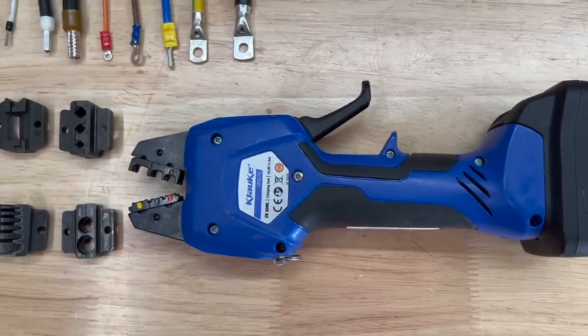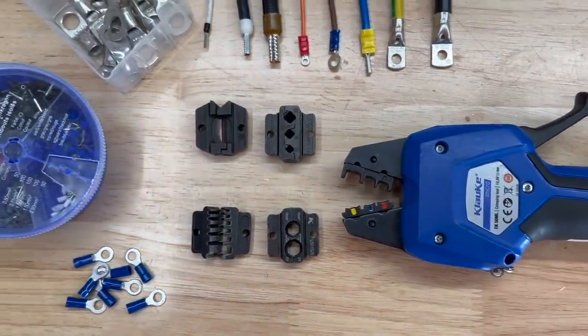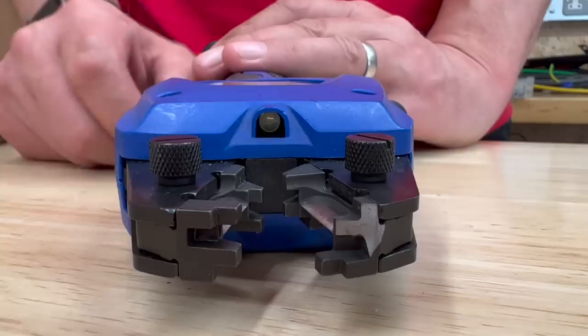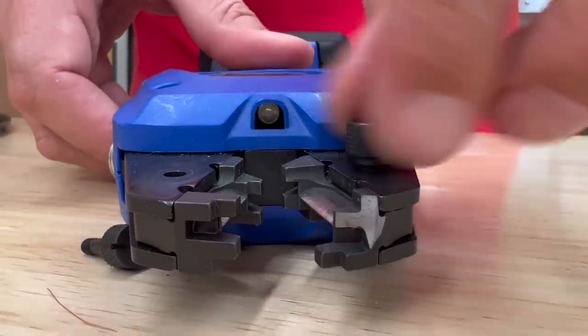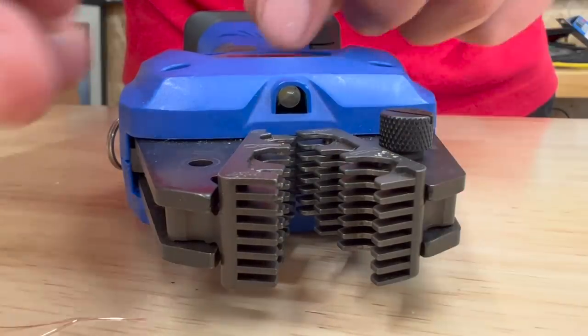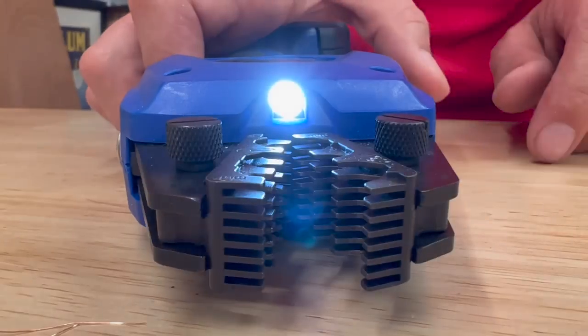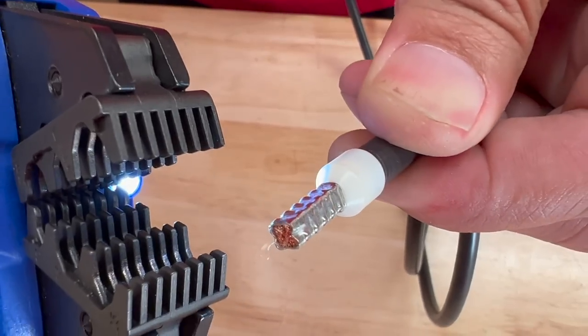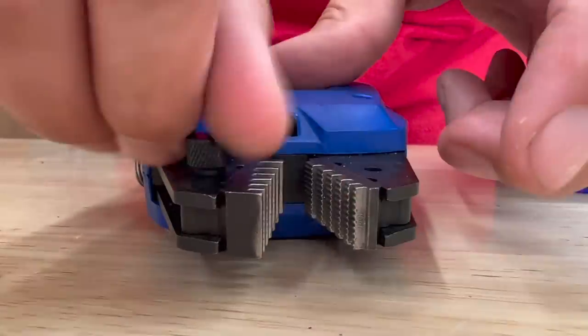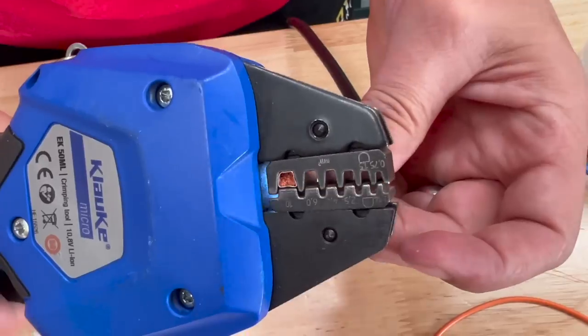While they're on with the mission, let's take a closer look at the tool. It has benefits even for the occasional crimper because you can use it with an incredible 50 different die tool crimp options. Changing the crimping dies is straightforward — they're held in place with two knurled screws. We've tried it with a lot of common cable applications including our favourite ferrules, which it can crimp up to 50mm squared. The die fitted at the moment will crimp 10, 16, or 25mm ferrule conductors, and a quick switch of die lets you crimp ferrules from 0.75 to 10mm.